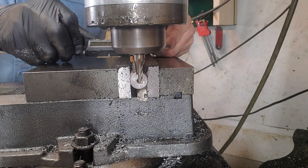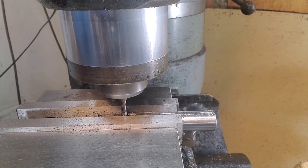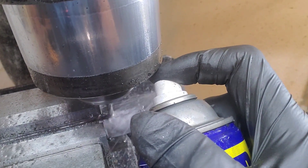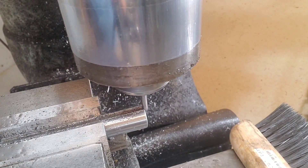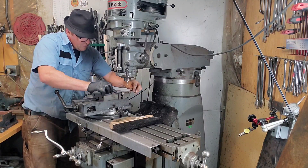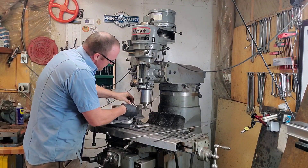The work did suffer a little bit — I could have done a better surface finish on this — but in the end it's going to turn out quite well. On the next one I'm actually going to do flood coolant off camera and it's going to turn out perfect. Listen specifically to what's going on here — that chunky noise is actually chips getting fed back into the end mill, chewing everything up, which is really not desirable. It's probably a better system to have flood coolant washing away your chips — in the end you're going to be happy with your product. I'm going to take these burrs off here, and I've got to be really careful to make sure the edges of the keyway are even because I'm going to flip this upside down and cut the other end. There's a nipple on the back that I'm going to go back and clean up later.